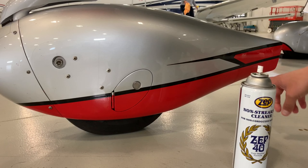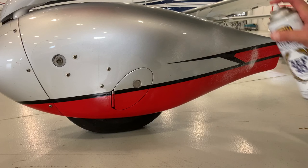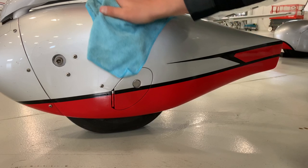Same thing with the nose wheel pant — sometimes you get a lot of fuel and oil leaking from the breather tube, so I'll use Zep 40 again, spray both sides, and wipe it clean from underneath. The plane looks great. I did the entire airplane with the techniques we just talked about. A clean airplane matters in our flying — it gives your passengers confidence and shows how you treat your aircraft. Please subscribe, hit the like button, and comment below if you do something different. Stay ahead of it and fly safe.